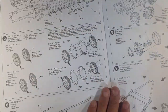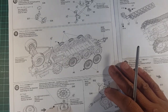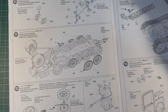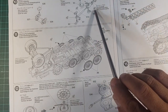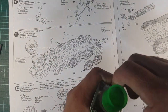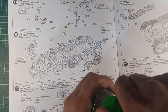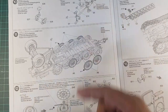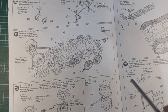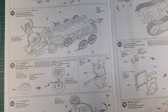And going to step 10, what do we got? We got the coupler assembly. So we have all this polycap. See, it does say don't glue there. What they're showing here is the Tamiya glue, and it's got a cross through it, so don't glue that part. And attaching front suspension. So everything you've just built, we're just assembling now onto the chassis. You're going to continue to keep adding more parts.